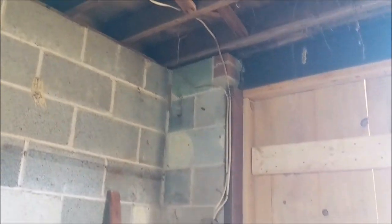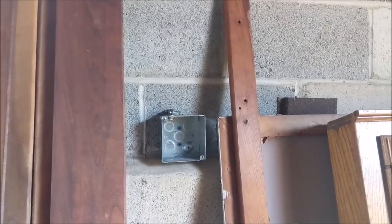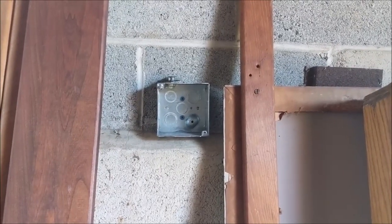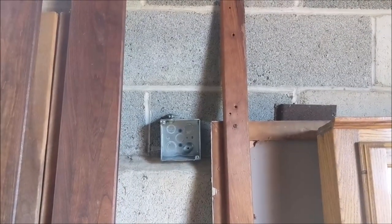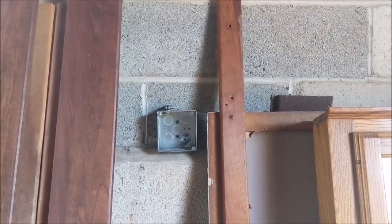There's an old original light fixture here with a penetration through the wall to an exterior fixture — ancient wiring that has all been abandoned and will eventually come down. What I've done is gone around the perimeter of the room and mounted four inch by four inch boxes on the wall in the locations where I want outlets. In a 20 by 20 area I've chosen to put two equally spaced on each exterior wall, plus one upstairs and a couple of exterior boxes not yet mounted.